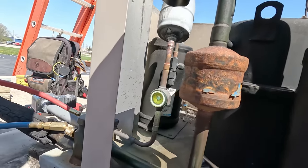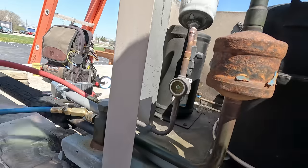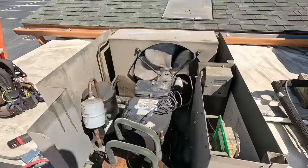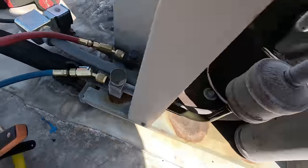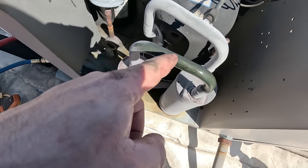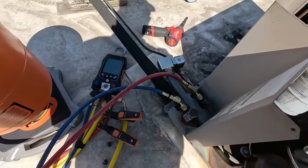Getting there. We're getting there. She's coming, baby. She's a coming. There you go. Now that'll fluctuate a little bit more. We're right there at 4.6 pounds. Pressure's dropping a little bit. She'll settle down. Probably could use a wash and all for sure. You can see the TXV starting to pull back a little bit. I've not dumped any in for probably about 2-3 minutes, so all that frostback is slowly disappearing from the TXV adjusting. Running about 8 degrees, 244 head.